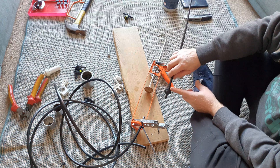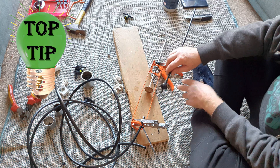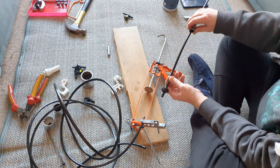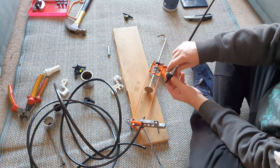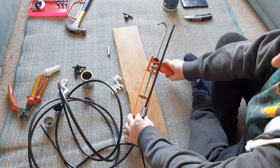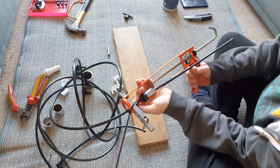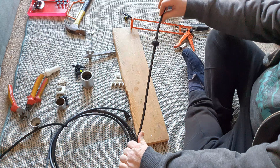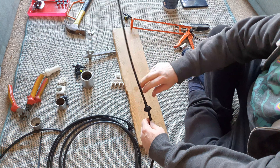If you are fitting one-way valves into your new assembly, fit the pipes to both sides of the one-way valve before you cut them to length and fit the end fittings. For the second side, choose a larger socket that will fit against the flat side of the body — the technique is much the same as before. Press against the socket, keep it all square with your other hand, and in we go. Now we can cut it to length at each end and fit our end fittings using our other adapters.